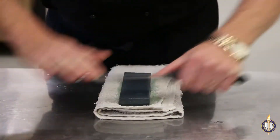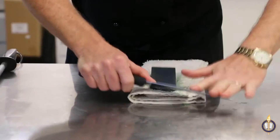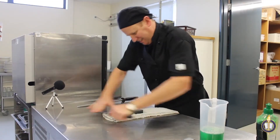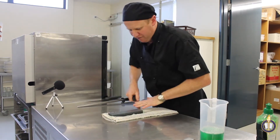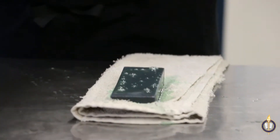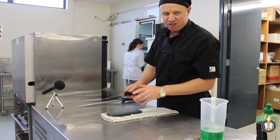We do 10 times on the other side, then re-oil or add more detergent to the stone. We count down — 7, 6, 5, 4, 3, 2 — and when you get to one, this is important: you do one stroke each side, 10 times alternating.